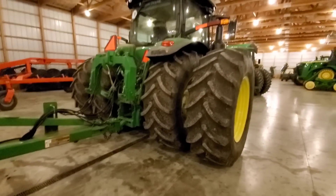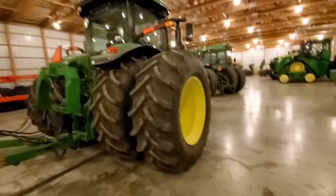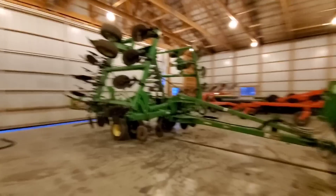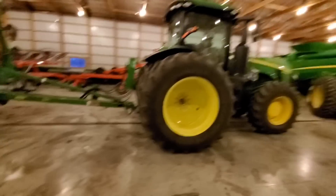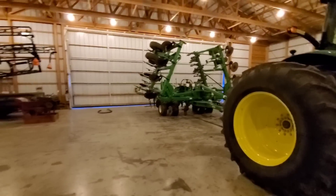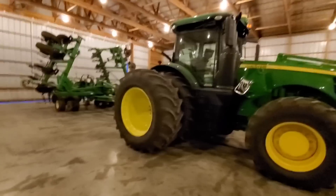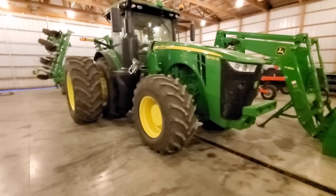This 8400 is truly an amazing tractor — the power is just unreal. 400 engine horsepower, and when we went to the 710 tires it seems to pull even better. We're going to see how it handles the 12-knife 30 with the dry cart. We're thinking shedding a knife will cut about 25 horse, but we'll add about 50 horse in requirements just to pull the dry cart — so that's adding about 25-30 more horsepower requirements. It's handling well right now and we're very surprised.